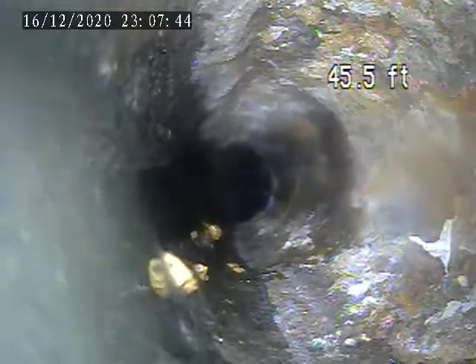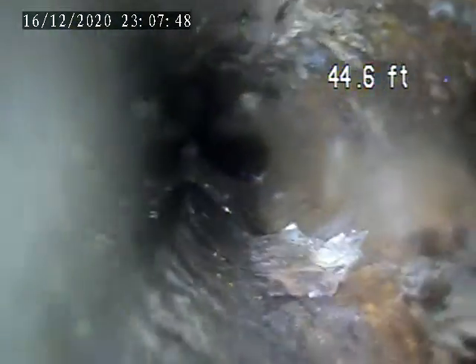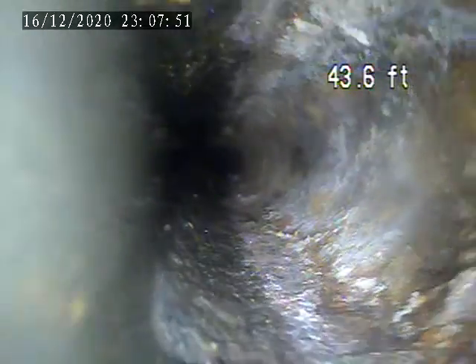I'm coming back here. There's a lot of deterioration in the piping. There's a channel out in the bottom. That's why the sewage is holding where it's at.